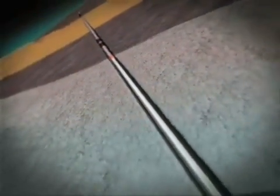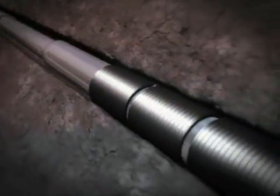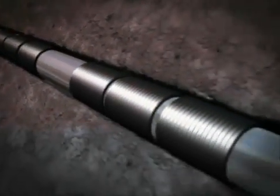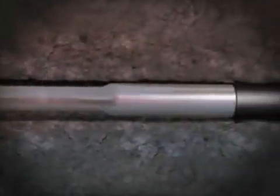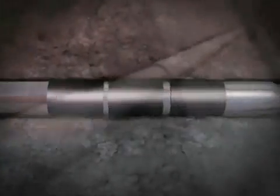Weatherford's EZI technology offers immediate open hole zonal isolation, independent of wellbore fluid, whether oil, water, or gas. Compliance expansion of the EZI joints, in conjunction with unexpanded blank pipes, provides unparalleled zonal isolation flexibility and functionality, usually associated with cased and perforated completions.